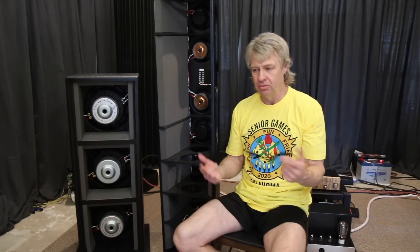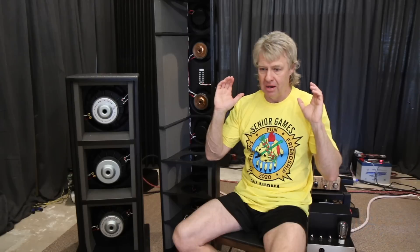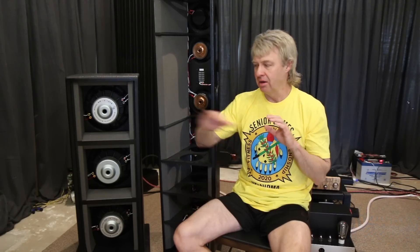It can be very similar to an uncontrolled driver if you set it that way. Ron Bernay mentioned in one of his recent videos he compared one of our kits with the servo subs to the Spatial Audio Sapphires — a great speaker and probably one of the best I could recommend if you just want to buy an open baffle speaker, open the box, set it on the floor, plug it in and go. Ron loved them, but he actually said he thought the bass was a little tighter on the larger-woofered Sapphire than with the servo subs. Everybody asked what he was talking about. I had to ask Ron: you still have your extension filters set all the way to 14 and your damping set on low? Which he did — and that's where I have mine most of the time, because I love for it to play all the way down to the rock bottom, and low damping allows it to do that even further.